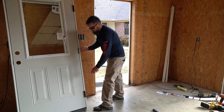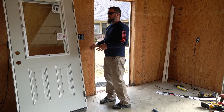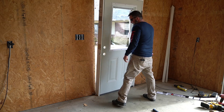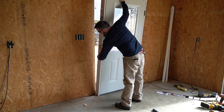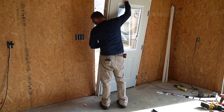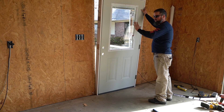Can you over-caulk? It'll seal fine, but the more caulk you put in, the more it'll squish out. If you're doing your front door with a nice hardwood floor, you could make a bad mess. If you're really worried about your floor, use clear caulk. Now I'm going to set the door in there, but first you've got to remove that little shipping piece that holds the door closed — just turn it a quarter turn. Now you can set the door in. I'm keeping it leaned back so I can slide it forward without disturbing the caulk. Once I lean it forward it starts pushing the caulk, so I want to position it right.